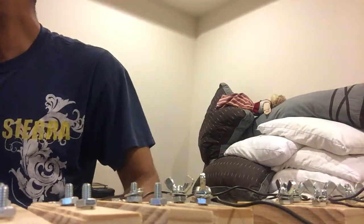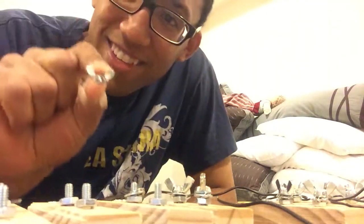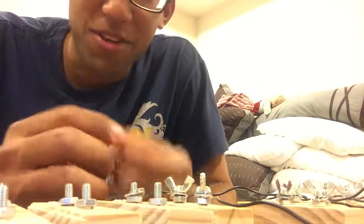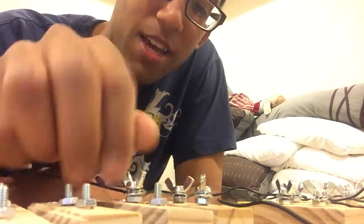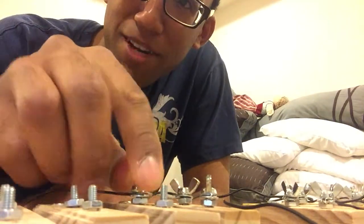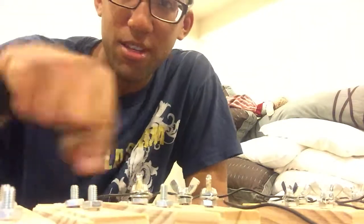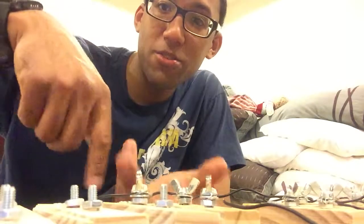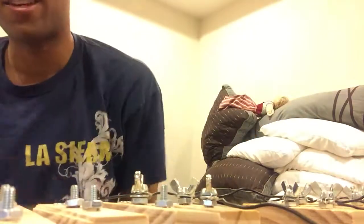Next step is to get some wing nuts — also called butterfly nuts — they look a bit like Mickey Mouse ears. At the store they're called wing nuts. Attach one onto the bottom screw to hold it all in place. Be very gentle — just go to finger tight. If you over-tighten, it will start turning the screw and you can crack the reed switch, which we definitely don't want.